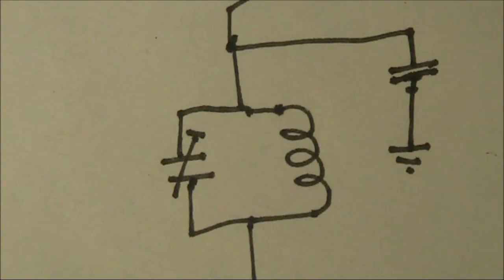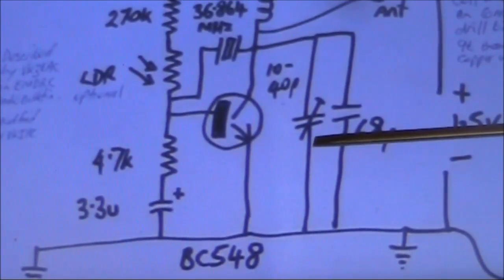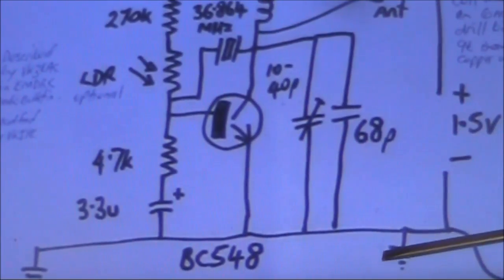Radio circuits have a habit of being temperamental, and those with trimmer capacitors are particularly so. Even something like a metal screwdriver blade can introduce stray inductance and capacitance, and that can make adjustment harder, especially if you're trying to align a sensitive VHF receiver, transmitter, or free-running oscillator. Very often, one side of the trimmer capacitor will be earthed.